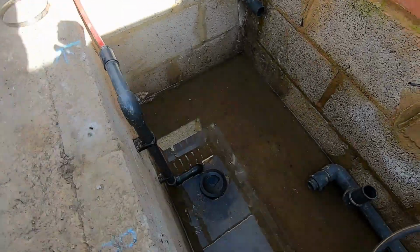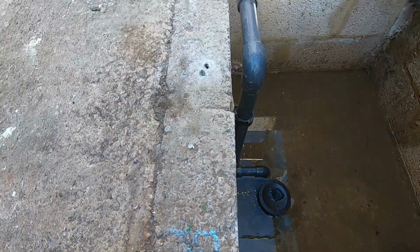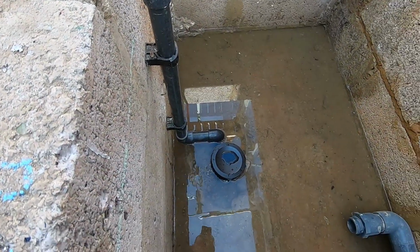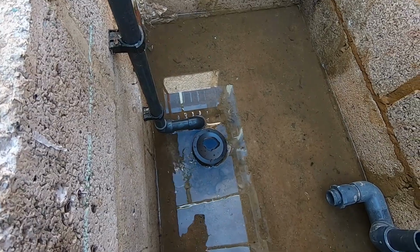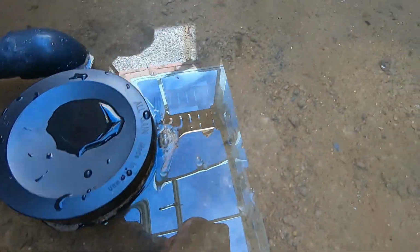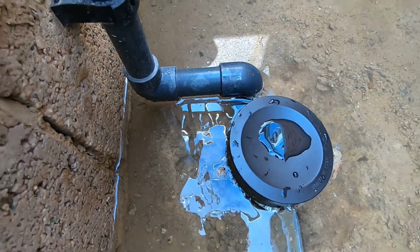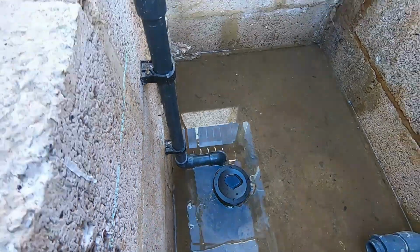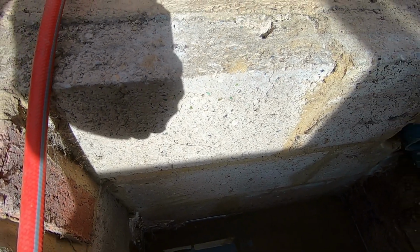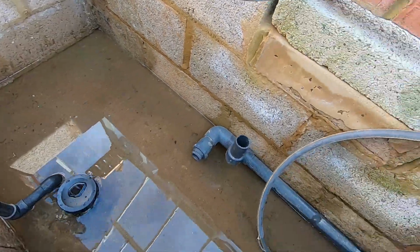So the idea is I cannot come up vertical because it will clash with the underside of the RDF. The air pipe will have to be moved, so that's why you can probably notice that I'm digging down around the fittings so I can cut the pipe and put new fittings on. I'll then get to this point where there'll be a vertical pipe coming up, and I'll be able to rod the 4" line if I need to. Hopefully not.